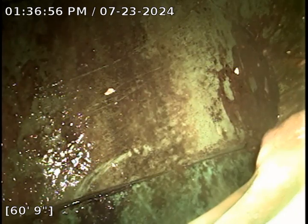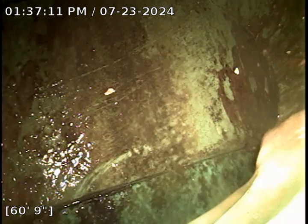I'm going to try and locate this position. Alright, this position is located in the middle of the street, right in line with the manhole cover in Southeast Clatsop. Not able to get a depth. Seems like it's pretty deep. My locator's not able to read that. But right here, I'd say, is the connection to the main as it drops down. So this main is going to be pretty deep since it dropped down pretty far from this point. We're not able to get a depth here.